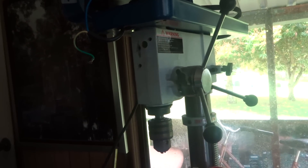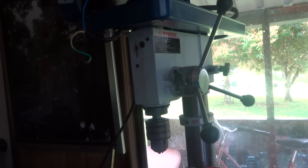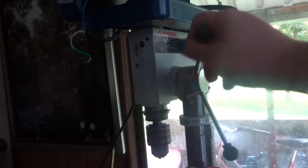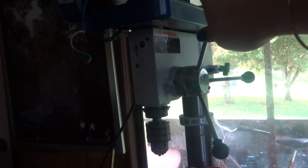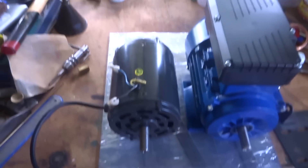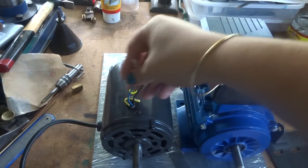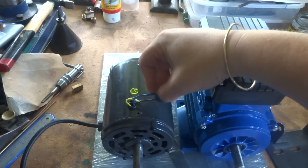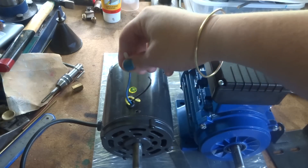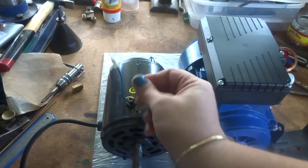It's not a bad quality thing — it's got a decent table on it. It's only 5-speed and half horsepower with a 3/8 chuck. It's probably the best one I could get in the size range at the time, but it's still pretty light and tinny. And this motor has given up the ghost — I think it's probably just a capacitor. I sourced a new one but it didn't happen really, and the connections are pretty crappy too. Maybe that was some of the problem. It's just junk.